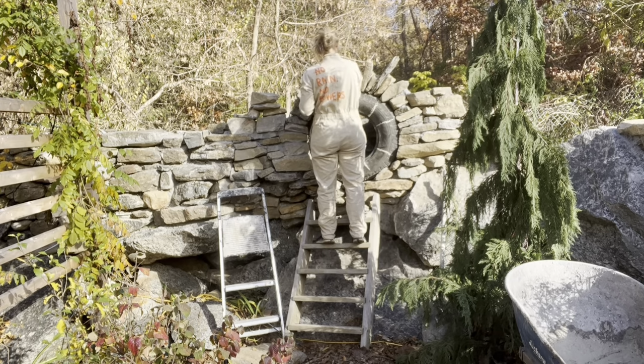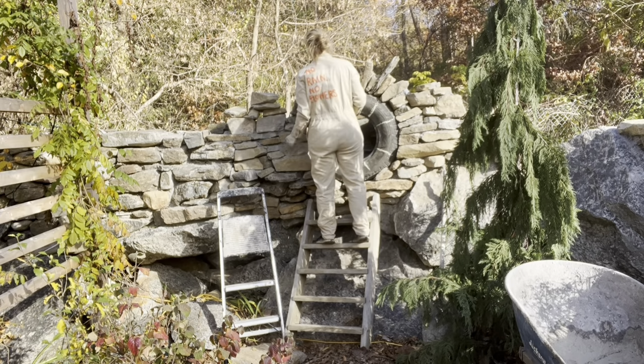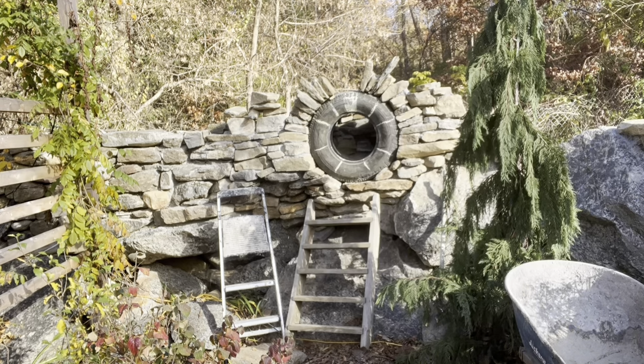That said, what worries me about this particular project is it's on top of boulders. So who knows? There might be a lot of movement and this might fall down, and that's what I'm worried about. Another thing is support on the side to handle the weight on the side. So there's another factor. But to be perfectly honest, keystones are very important, but on a small arch like this, it's not the end of the world not to have a perfect one or even one at all.